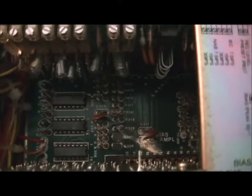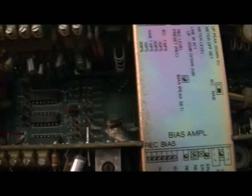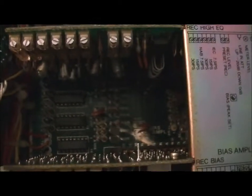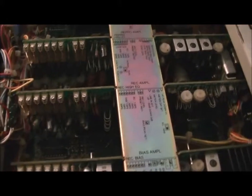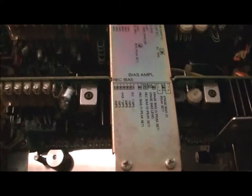When you're pulling these out, the method I use is to actually cut off every single pin, pull off the plastic, and then you pull out the pins one by one. And then with a vacuum solder sucker, you can suck out each of the individual bits of solder in each of the holes. If you're not careful, you will probably at some stage take out a via. Some bright spark had already worked on this machine before, and I've found about four vias missing. They're actually in the analog cards, where there's nothing connecting the top and the bottom of the board. So the via was totally missing. They pulled it out when they changed some transistors, some FETs actually. So that's words of wisdom.